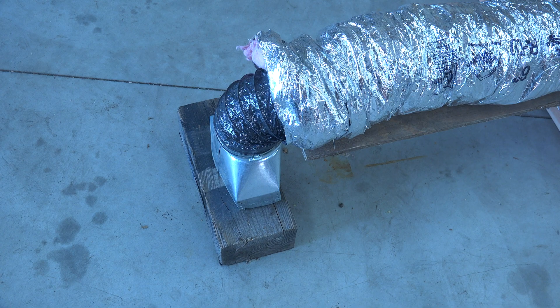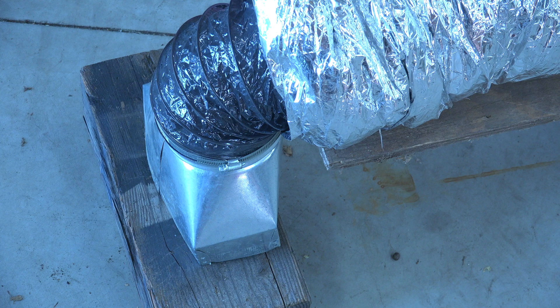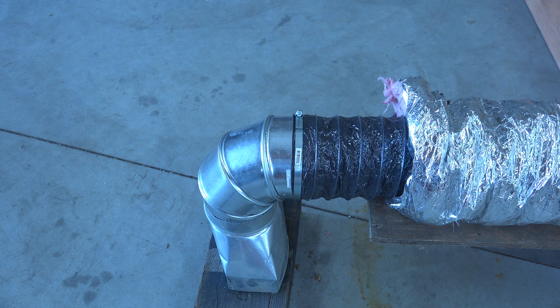So I don't like it that way — I want that hard pipe elbow there. Here we have a straight boot on the end, and when you look at that, it's too sharp. It's not going to flow like it should. It's squishing down and it's only going to get worse. This is the way I would want to do it — I can stretch out the flex duct so it has very little flex. As long as it's straight, it works pretty well. I'm a service tech; these are things I've seen in the field that I've had to fix because the job was done sloppy.